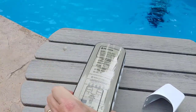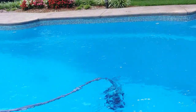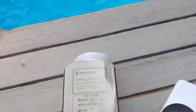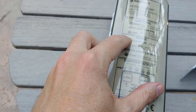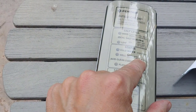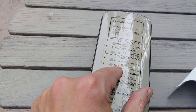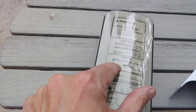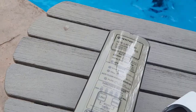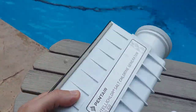So how do you know when it's bad? My chlorine level was so low the other day that something had to be wrong. I walked over to my cell and this light was flashing — 'inspect cell.' That means maybe you need to clean it, or it's at the end of its life. Most people say that when that's flashing, it's usually at the end of its life.